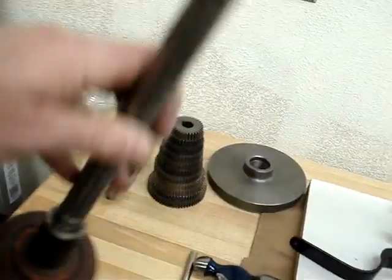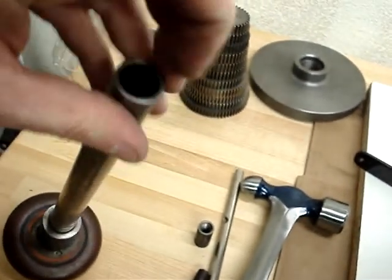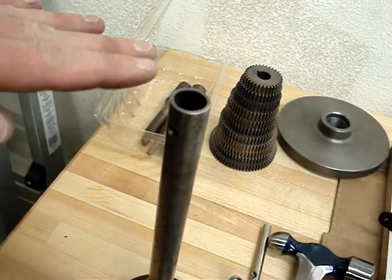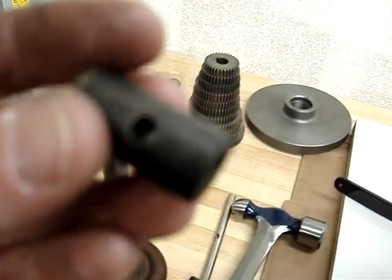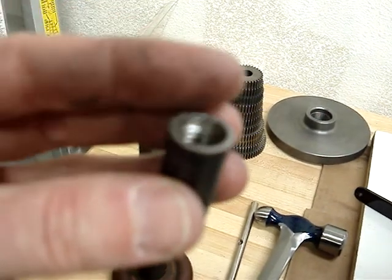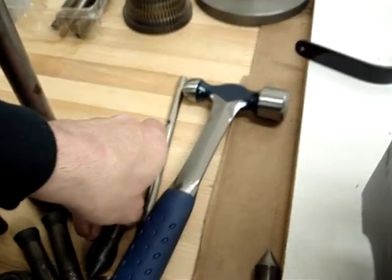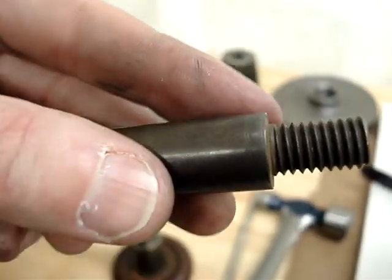On the draw bar that's been modified, I drove the pin out and as you can see, there's no threads in here. I'm wondering if maybe they chopped off the threaded part and then just manufactured this and pinned it in place. And then that is what allowed the collets to thread into. It looks like kind of a homebrew affair from what I can tell here.